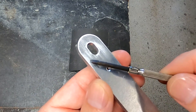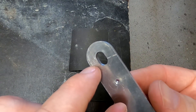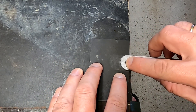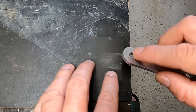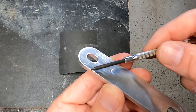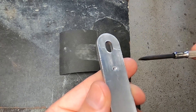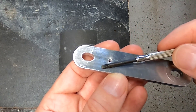If we assume the bus bar is a little bit concave, it should be the other way around on the other side. Let's do the test. I'll just move it up and down five times with very gentle pressure. There - you can see it again. Around the edges white, this is where the sandpaper has taken away material. It's darker here and white over here along the edges again.